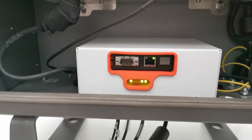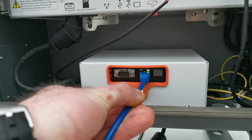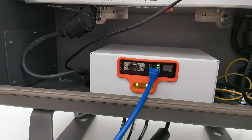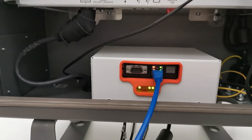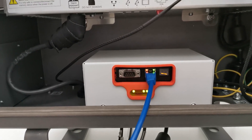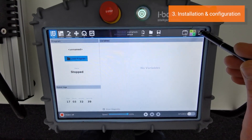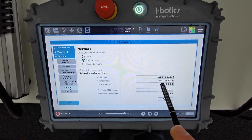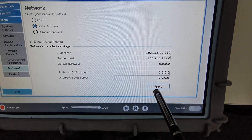Now all three green LEDs at the bottom will glow continuously. Insert the Ethernet connection to the drive unit. The drive will then show its IP address — make sure it's the same one as in the documentation. Go to your settings and first check your network settings. Put in this IP and subnet mask, then Apply.